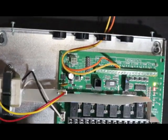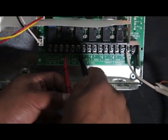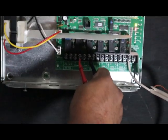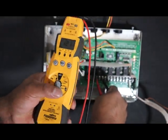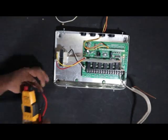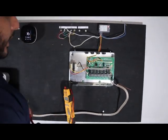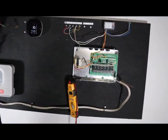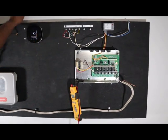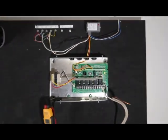Zoom in — we're closing from R and W, so we check zone 1 on the line voltage side: 120 volts. That would be going to your circulator pump. Let's de-energize it — let's say the room hit temperature. It's going to de-energize both.